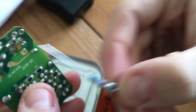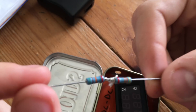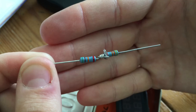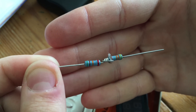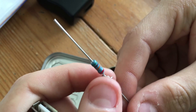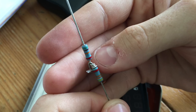The next step is to take your resistors — in this case I'm doing the resistances for the data plus line. We have a 43.2k resistor and a 49.9k resistor, but really they're 43k and 51k which is close enough. I'm going to solder them together. Basically you put the 5 volts on one end, ground on the other end, and you'll end up with 2.7 volts at the midpoint.